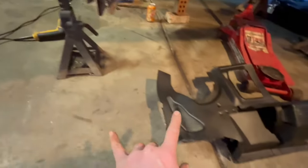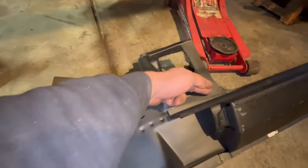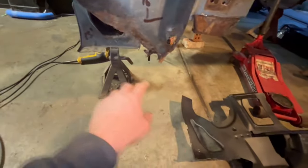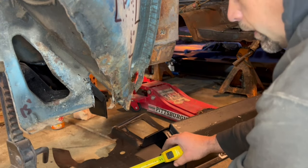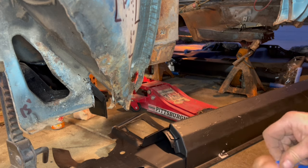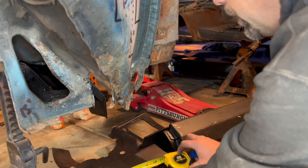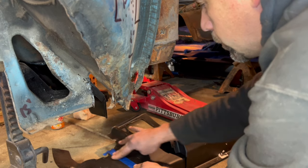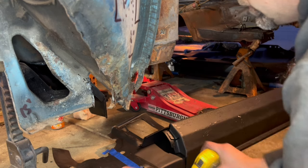We're going to measure from there to there, then transfer that over, then do a straight perpendicular line and cut this leading edge off. Then do the same thing on the inside — figure the height we've got to cut it at, and we'll cut all this off because I don't need it and it's also damaged. I'm going to use masking tape as a line to cut from, making it just a little bit big because it's easier to remove metal than to add it back. I'll cut just under seven inches — about a sixty-fourth or thirty-second less — straight up. On the inside, there's a straight cut all the way across, pop a little circle as a reference point, then come down about thirty degrees and cut back into the line.